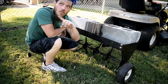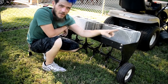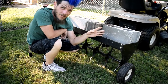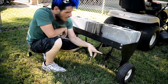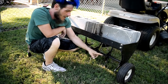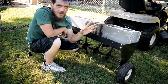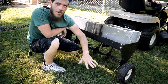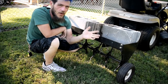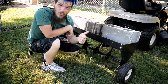If you live in a newer neighborhood where all the power lines, cable, and phone lines are underground, you'll want to get those marked out so you don't run over them — some of those aren't very deep and the tines will actually go deep enough to pierce them. I used to work for a professional lawn care company, and I've seen people get a little too close to the paint, or lines weren't marked, and the tines cut a phone line or cable line. In newer neighborhoods they sometimes just lay the lines in a saw cut and that's it — not very deep at all. Gas lines and water lines are about three feet deep below the frost zone, so I'm not worried about those. We're good to go.